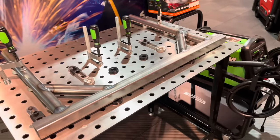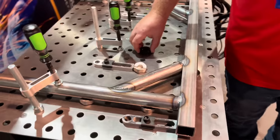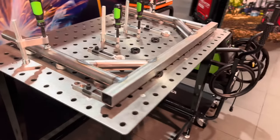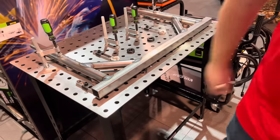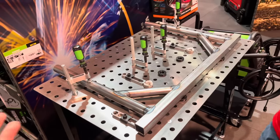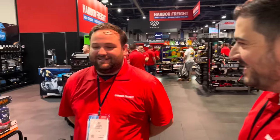Now let's talk about the fixture table. It's a three-by-two fixture table that comes with all the clamps you'll need, V-pads to keep things flat and square. You can set things up flat, raise them, use V-pads underneath round tube, spacers for flat tubing, and work stops for repeatable fixturing. You can use it as a tabletop or standalone. There are feet behind the legs — take the outer leg off and it sits right on the table. If you've already got a welding table, you can add this for $169.99. You'd spend that for jigs anywhere else.